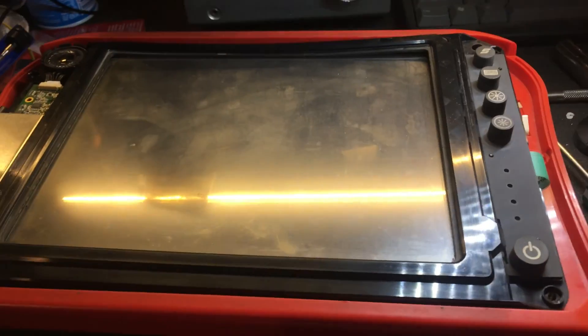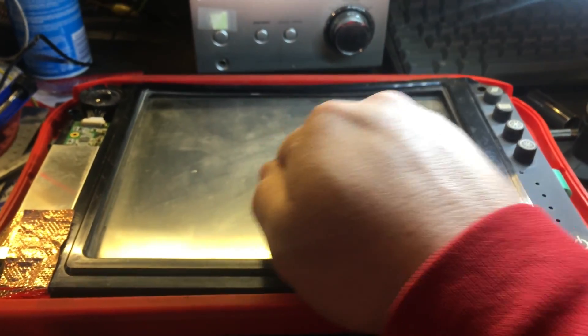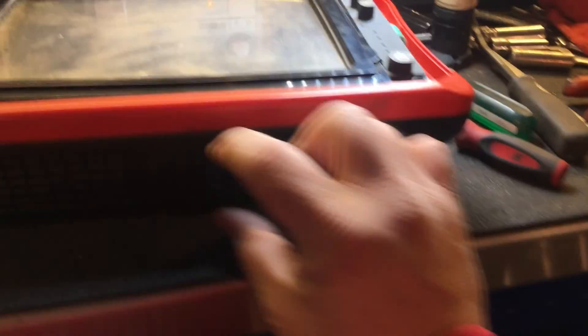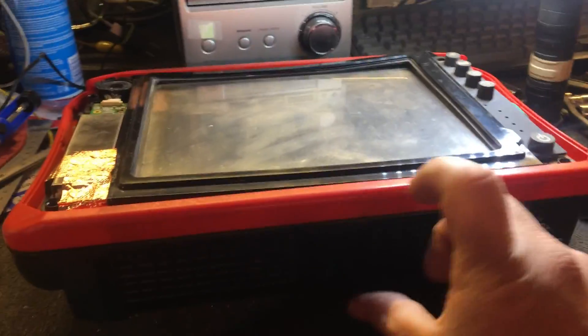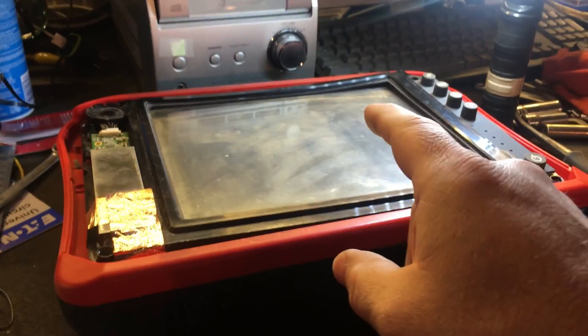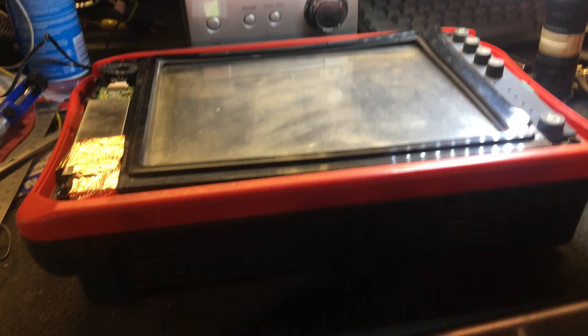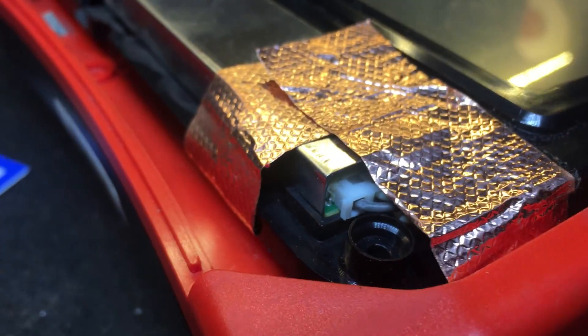It's important that you take the shroud off, because there's a very fine cable that attaches the screen to the motherboard underneath. You can't just take apart these two sections without destroying the cable and ripping it off the motherboard, which would obviously be a disaster. I only learned that because I was carefully taking apart these two pieces and I realized I couldn't quite get into anything. I could see that ribbon — it's not really a ribbon cable, it's similar — going into the motherboard. This cable connects underneath this board, underneath this foil tape. There's a plug that's going to have to get disconnected.